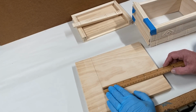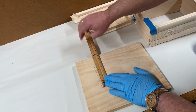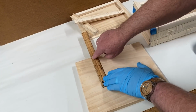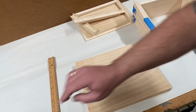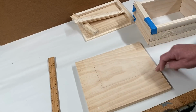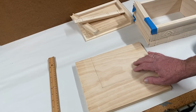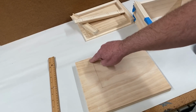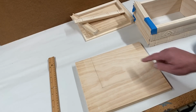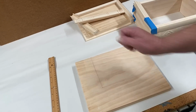Okay, that's right on, 8 1/4. By 5 13/16. So I know that these miters were cut correctly, and so I've got that. I'll just cut this out on the table saw. Now, if you confirm those dimensions are correct, you could create just a simple rectangle in VCarve and cut out this bottom piece on the CNC machine, 8 1/4 by 5 13/16.